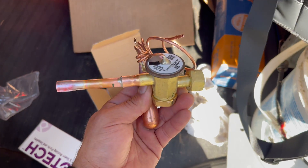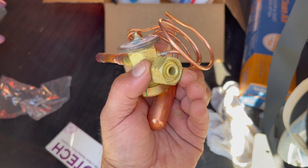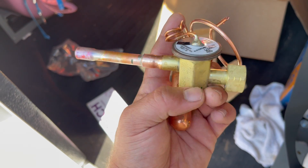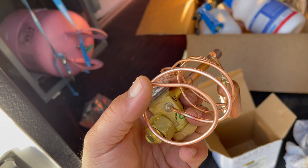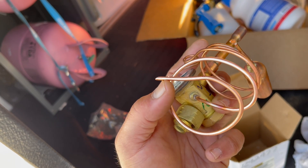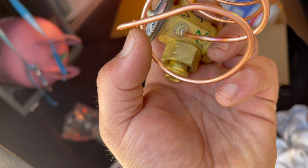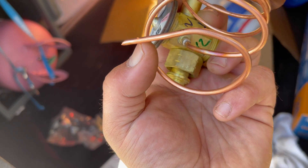It's really best just to leave them in the box until you're ready to install them. With this type of TXV, it does have one end that is a nut fitting, but the other end is going to be sweat. So you want to make sure you're flowing nitrogen through the system and keeping this valve as cool as possible. With this type of external equalizer, we're going to have to unsweat the other end because it's just stuck down into the suction line and soldered. So we'll unsweat that one, pull it out, and stick this one back into the hole that's pre-made in the suction line, and then solder it back up.